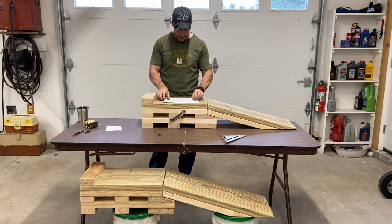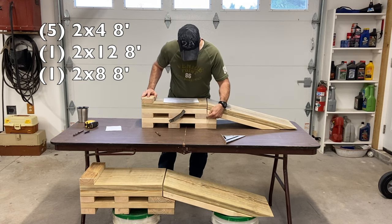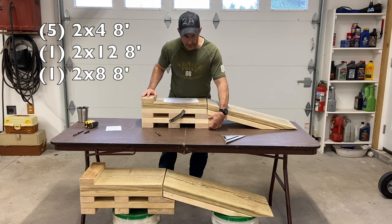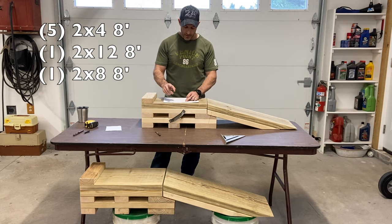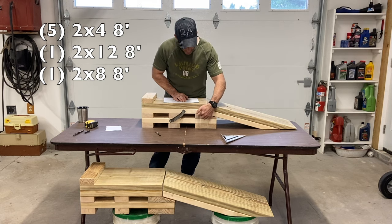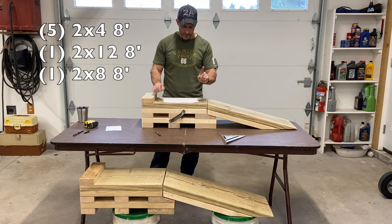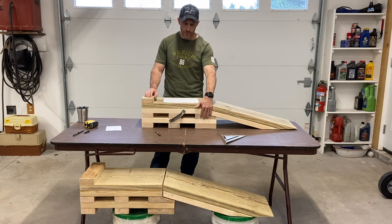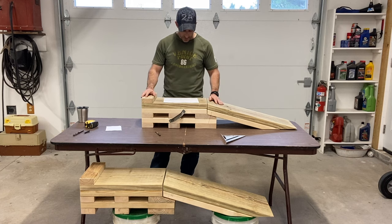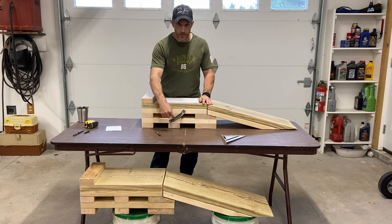All right, the last thing I'm going to tell you, and like I said, I'll put it down in the description, is what I came up with to build this exactly like I built it, with this being a 2x8. Now you could replace that, like I said, with 2x4s or 2x6. You're going to need 5 2x4s 8 foot long, 1 2x12 8 foot long, and then you can skip this last board if you just make these 2x4s, or if you have a scrap piece of 2x8 or 2x6 laying around. But if not, you're going to need 1 2x8 8 foot long. The problem with that is you're only going to use about half of that. That's why I said you could maybe try to make this different if you want. I have a lot of scrap pieces laying around. And then you're going to need 3-inch screws and wood glue, and maybe 2 handles if you want. It makes carrying them a lot easier.